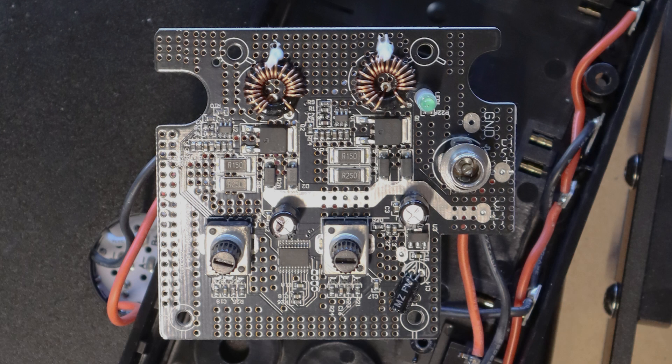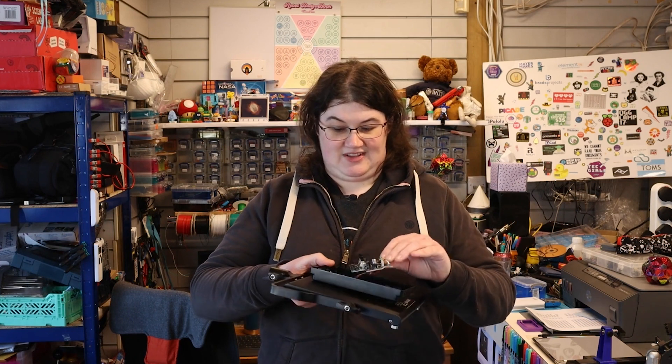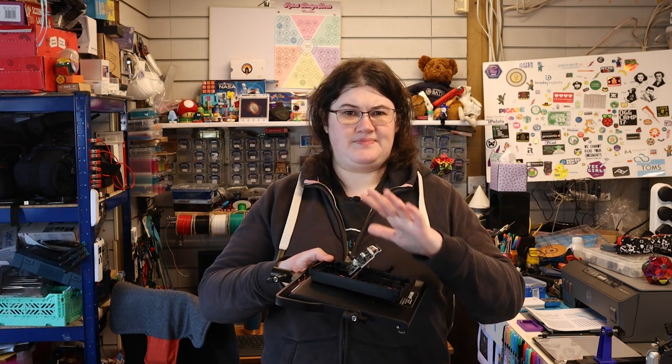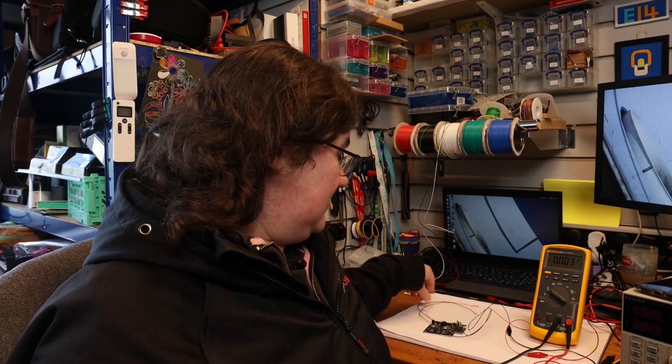So I can see that there are almost two identical circuits in here. That's because these lights have a control for the tone, so that makes sense - there are sort of two identical cool circuits inside. I'm going to guess that half of it goes to white and half to yellow. I've taken the control board out and I've disconnected the things that were hardwired - the output to the LEDs and the switch connections - and I've just attached some test wires so it's a bit easier on my desk and I can connect in and measure.